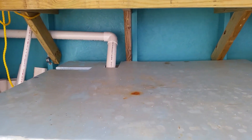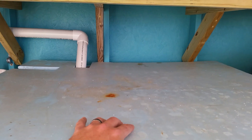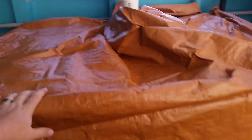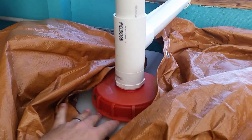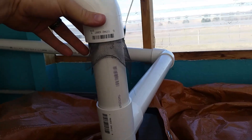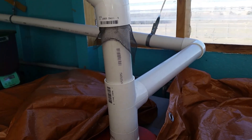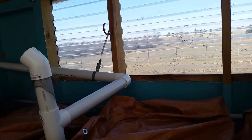If you test the water it's coming out at three parts per million, which is almost equal to reverse osmosis water. The pH starts at seven, but I just tested it today and it's down to about 6.6 — that could have been because the last rain was a little more acidic. I also added an extra tote on the other side and covered it with a tarp so we wouldn't get any algae. I tied it into the lid with a standard fitting from Home Depot and put a screen vent on it so there's enough oxygen flow during heavy rain and it won't pressurize itself. That tote catches from around 300 square feet of roof space.